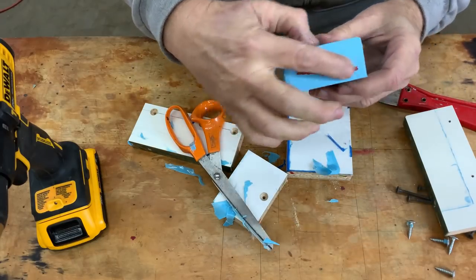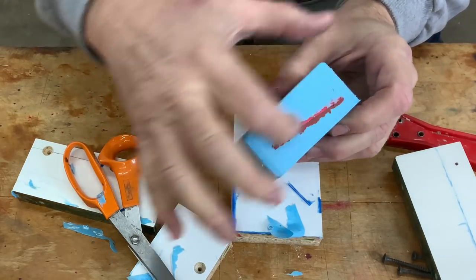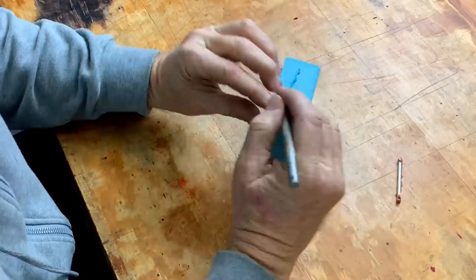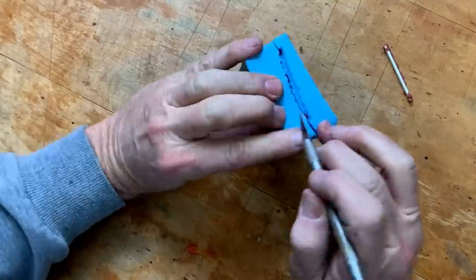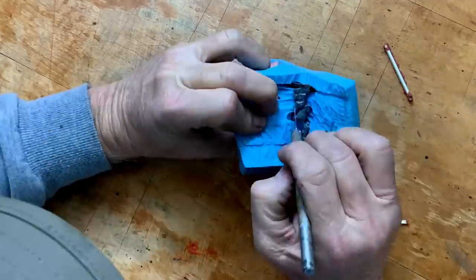Here's the bottom where the parts attached to the mold box, and that's going to tell us where to start our cut. I'm ready to cut this mold and I'm going to take my time, go slow, and follow the parts down as I open the mold very carefully, because the success of this mold depends on how carefully I place the parting lines around each of the parts.